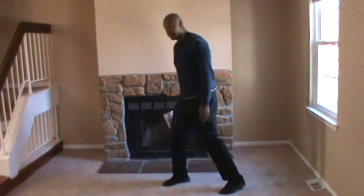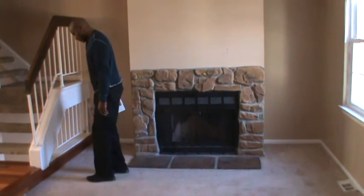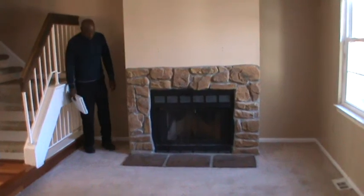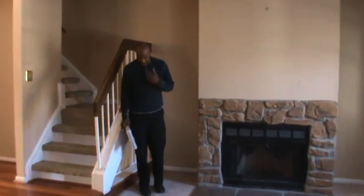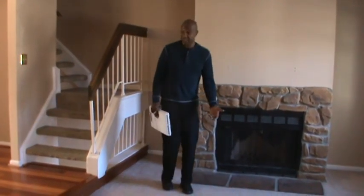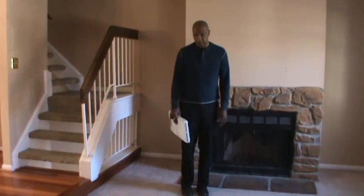What do you think, Sid? I would pull the carpet up, and the subfloor's messed up. Yeah, we do the subfloor, because without the joists, you've got to shim it up and tighten it down. I don't think the joist is as bad as having to replace it. The subfloor under here probably needs to be shimmed up, because you have to address it eventually anyhow, and might as well go ahead and pull the carpet up now.